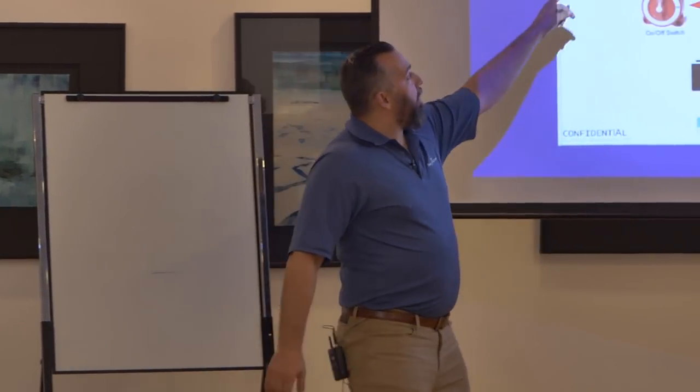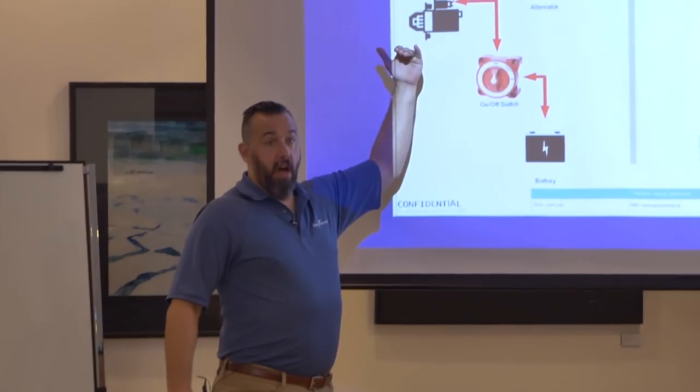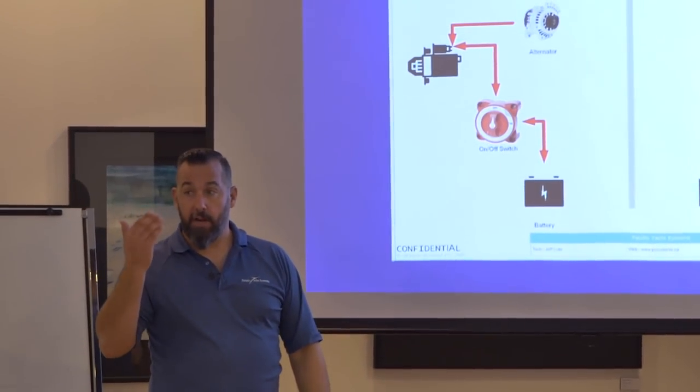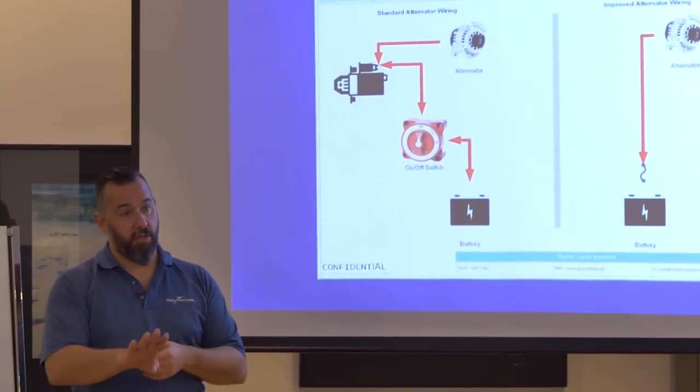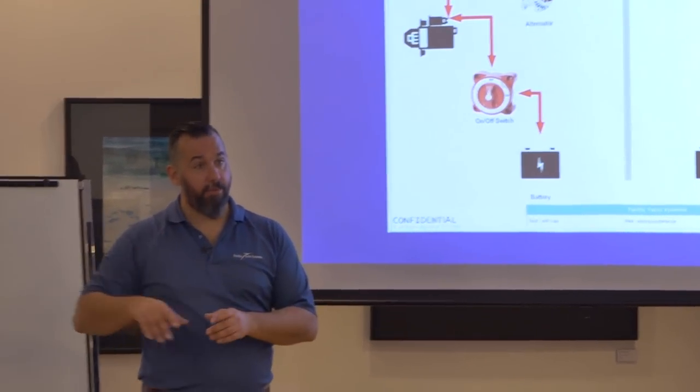The amount of rewiring I've done on boats is crazy. It doesn't matter what your background is — it's about doing it right. If that cable ever comes off — especially on an alternator, think about the vibration — and it lands on anything on the engine, which is a ground path return, that's it. You lost the boat. Game over. It's a dead short.